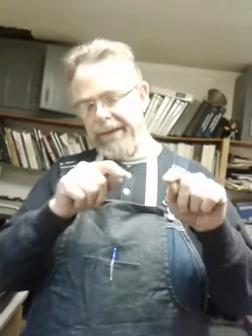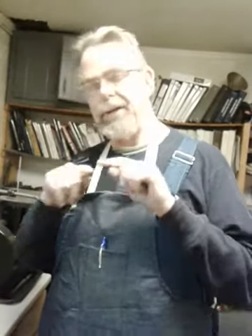The next step — I'm not going to show this — but I'm just going to take some 400-grit sandpaper and polish the commutator just to smooth it up really good. Then I need to make sure the grooves are clear, because copper grit between those little grooves can short the bars together. I'll clean that out with a toothpick like I showed you, and we'll have that commutator about ready to go. That's it for this episode. Sorry about the little hiccup with the video, but we're amateurs still figuring this out. If you've got any questions, put them in the comments and I'll try to answer. Thanks a lot, see you later.